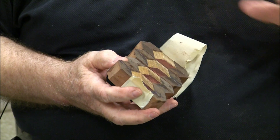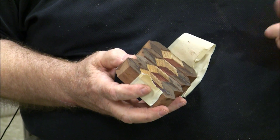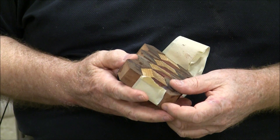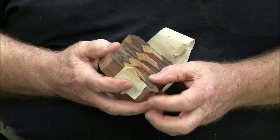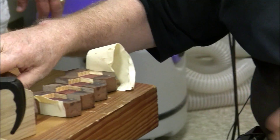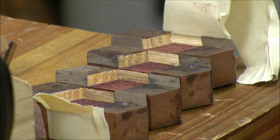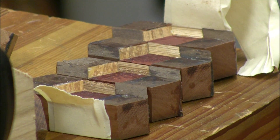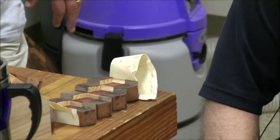It makes all kinds of uses for decoration for furniture. I've got some of these patterns on top of tables, some in the top of a chest of drawers — a chest of drawers that's low enough you can still see the top. I've used the diamond pattern in the legs, laid it into the legs of some of those tables. There are a lot of different ways you can use these patterns and shapes in woodworking projects — tables, benches, whatever. It really adds a decorative effect and it's not that hard. You get it set up to cut these diamonds, you can cut them all day. The diamonds are really easy, and gluing them up is not tough. Just re-saw them, use some 1/8-inch material, and lay up a tabletop. It really makes for some nice furniture decoration.